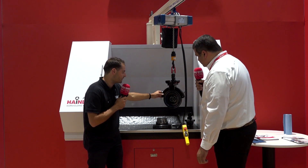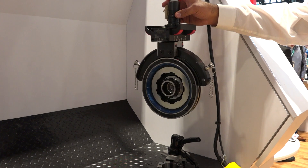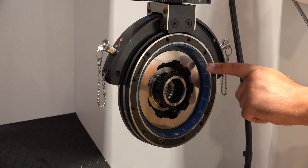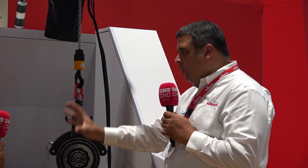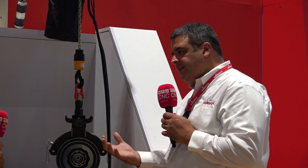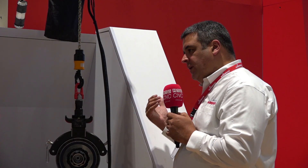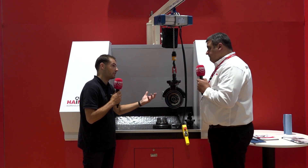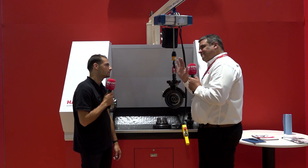Let's move on to the accuracy of the system, which is really important. This back face, all the little mechanical interfaces here — how does it stay accurate and what kind of accuracy can you get out of it? The accuracy is a very good question. The manner that it works is using this blue band — a vulcanized rubber strip that has ball bearings placed within it at very specific intervals that allow the system to be located correctly onto the spindle face without having to indicate it every time you install it. From a perspective of accuracy, it's going to be a stack-up with the work holding itself. However, the system itself — we're talking about five microns, just this interface with the corresponding taper on the spindle. Which, if you've got a standard chuck, you'd be talking way more than five microns. And of course, that's five microns in addition to whatever inaccuracies your chuck has, but the system by itself it's about five microns.